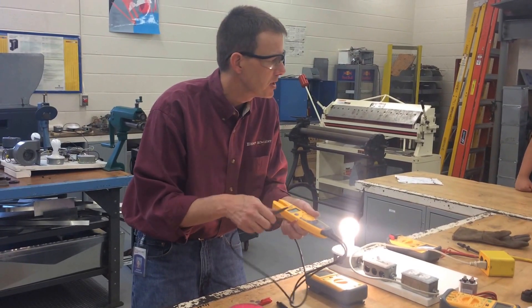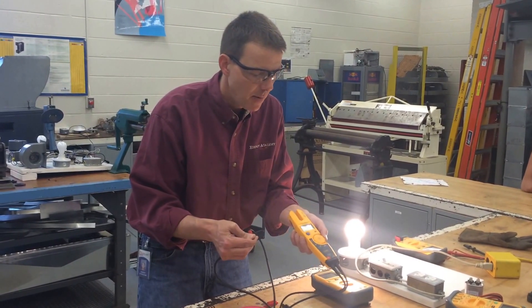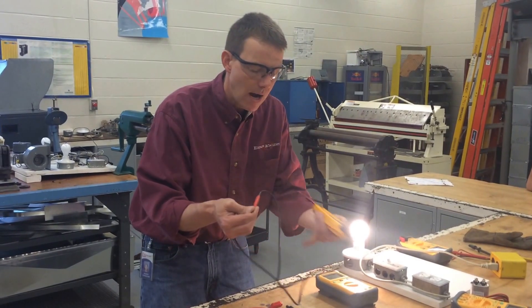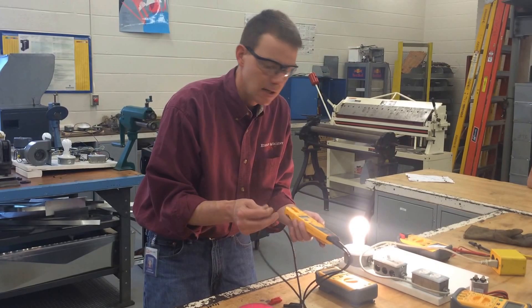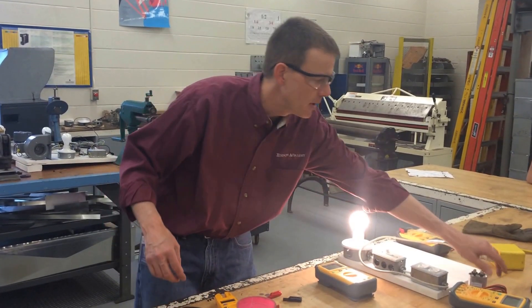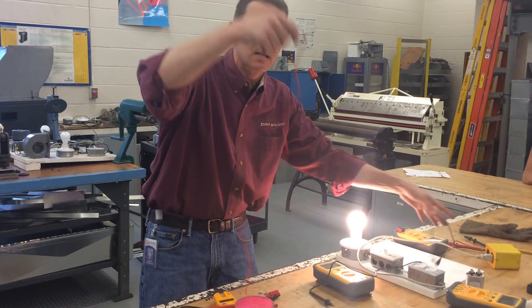There's also another symbol for it, but that sound means you can check for a continuous loop — that you've got a complete circuit, and it makes a tone. So with my conductors, power source, and the load for this circuit, the sound and the meter itself show you about one ohm resistance. The wire through the meter has about a one ohm resistance. When you're measuring a wire, generally if the wire is good, it will measure zero resistance.